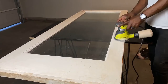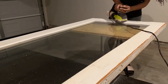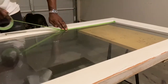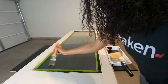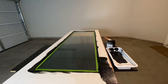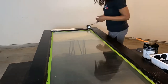For this project, I'm going to start by sanding the door down completely. Once the door is sanded, I'm going to wipe away any dust and clean it off to ensure nothing sticks to the paint. I taped the edges of the glass to get that clean, crisp line at the end and proceeded to paint. I'm using a generic black high gloss paint — I believe this one is by Sherwin-Williams. I'm adding some Floetrol to it to help prevent any brush strokes. Once this side of the door was painted, I let it dry overnight before flipping it to the other side and painting that as well.